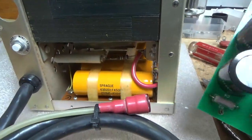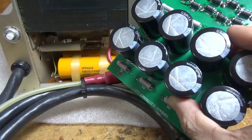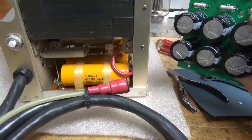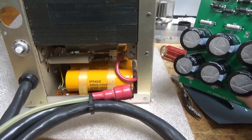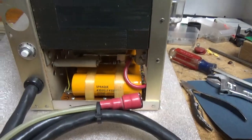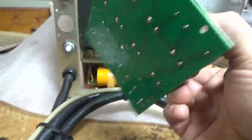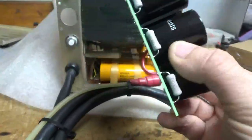You have to be careful — there are some fake boards out there. They use really crappy caps and they don't show you the side of the caps, just the top. I've had amplifiers come in where caps have actually popped, and two different boards where they actually popped and it looked like they possibly burnt up, like lit on fire a little bit. So I use all new stock, highest quality parts — no used stuff from some unknown source.